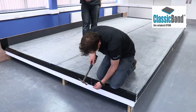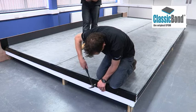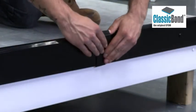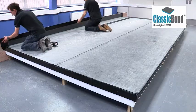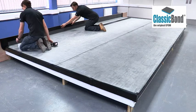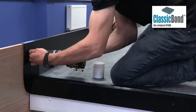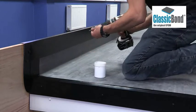All Sure Edge PVC trims require an expansion gap of 1mm per metre of run between lengths of trim. Attach the joining clips and corners — a plastic adhesive applied to one side accommodates any movement and is used to complete this. Finally, fix the Plastisol steel wall trim into position. Secure with washered fasteners installed at a maximum of 500mm centres. Plastisol steel trims can be sealed in the wall chase using an appropriate mastic or sealant.